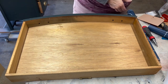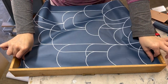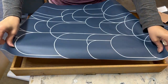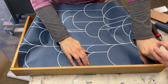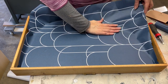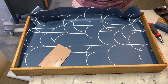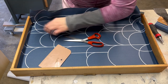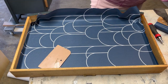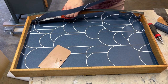I decided to go ahead and line the drawers. I'll do a nice clean before adhering the peel-and-stick wallpaper, then do a dry fit first — lining up the straight edge along the back and trimming the other three sides. I like to use my hands for the initial spreading since it's more gentle; some of these brands tear really easily. I'm using a Bondo spreader, and I use my fingers to gently push it into the corners. If there's too much paper in a corner I simply trim it — too much paper means you can't get a nice clean cut.